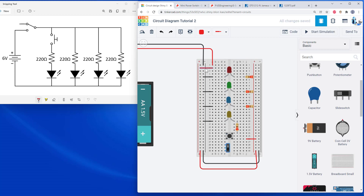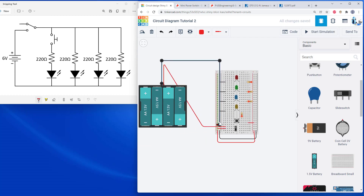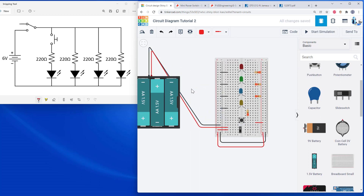For example, it might be more convenient to have the button and switch all the way down next to each other, though the trade-off is a wire routing all the way down there. I could reroute the battery pack wires to accommodate that. This is electrically equivalent — running the simulation confirms the switch still controls master power and the button still controls the yellow LED. Physical layout affects the user experience but not the electrical behavior. Future videos will cover transistors, operational amplifiers, and integrated circuits like H-bridges.